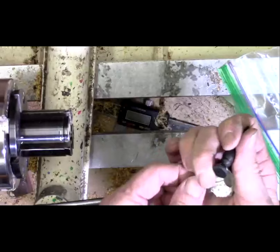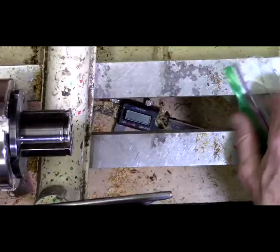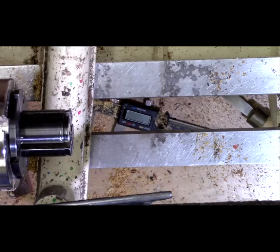When I put this one together, I will put a toothpick. I will drill a little small hole in here, and it's somewhere around a number 45 drill bit, I think works for the toothpick, but measure and check it. And I'll take a toothpick and measure it to match it. And I have one to, let's see. Have that on another chuck.